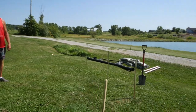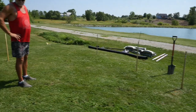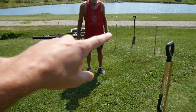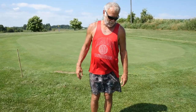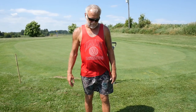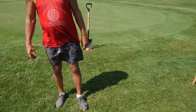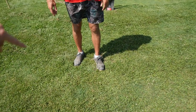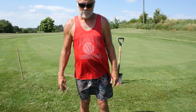There's a drain that runs here, there's a little branch that runs off the side of the green here, runs out, connects, and also one over here that runs all the way down. So basically, our bunker has to fit in this area right here. I want to make a circular bunker. I feel like that's the best way to do it. Now what we need is to find center between these stakes. I want to drive a piece of rebar down, tie a piece of string to it, and make a perfect circle right here. Then edge that circle and use the tractor to bucket out what we edged.